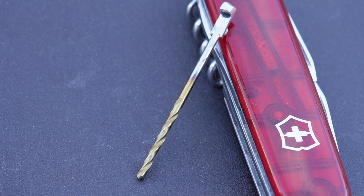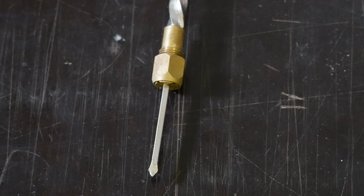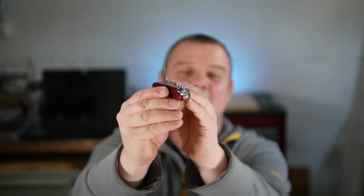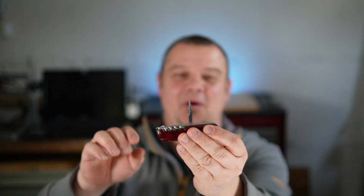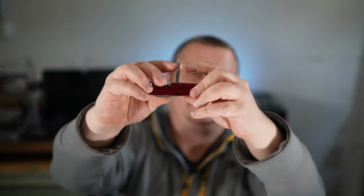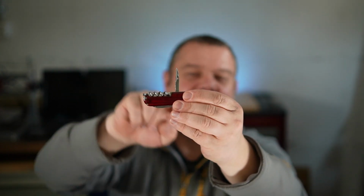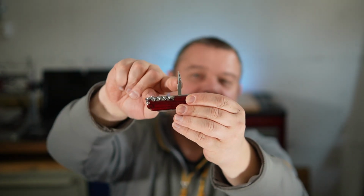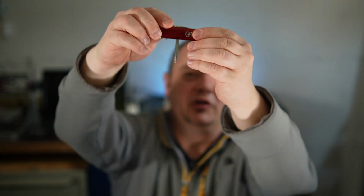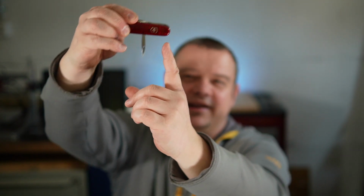And of course, also a normal spiral drill works for this task. But hey, in my opinion, these drills with the lens-shaped drill tip work more efficiently. If you try to make a 2 mm hole with the reamer, this works, but only if the hole is not deeper than 2 mm, because after that the diameter is too big. And if you want to make a deep hole with the reamer, it doesn't really work well, because the reamer is not symmetric. That means the hole always tends to run away from the center line like this.